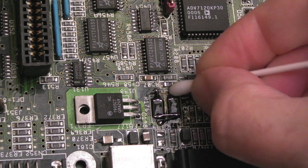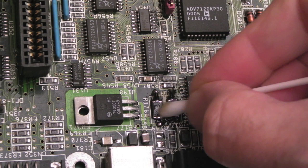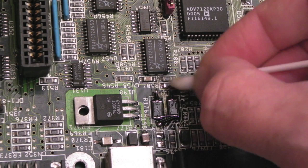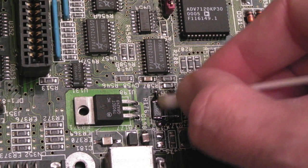So you could argue, yeah, it doesn't look that tidy, but that's about as tidy as it's going to get. When you've got that amount of damage around there, what are you going to do, really? You could start using copper tape to replace the traces and things like that. As I say, if there were contacts to these components that went to vias, I could mount these wires on the underside. But there's no fix really, there's no solution. You've got to do something like this with some fixed wires on the top side here.